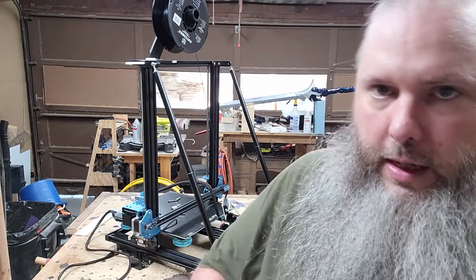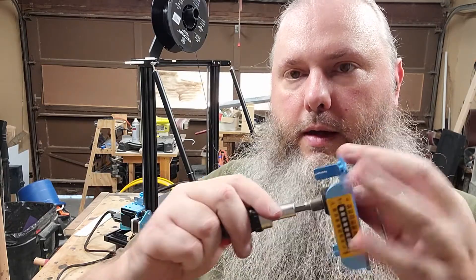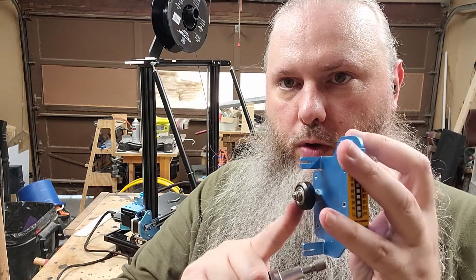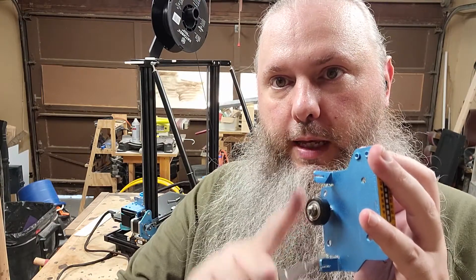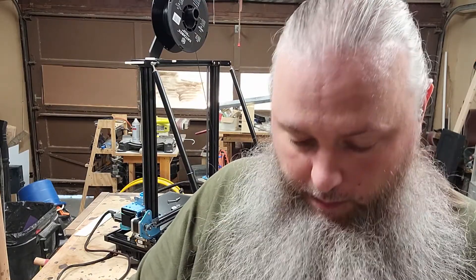This is a lesson on how pulleys work. You have good quality bearings and bad quality bearings. Right now this is tightened — I can tighten it more, but it is tight. If this rolls and you feel grinding, that's a problem. If this rolls smoothly and easily without resistance, that is in good condition — that's the way you want it. There are times when that is not the case and you need to fix that, or you will wear those bearings out and they'll just fall apart on you.